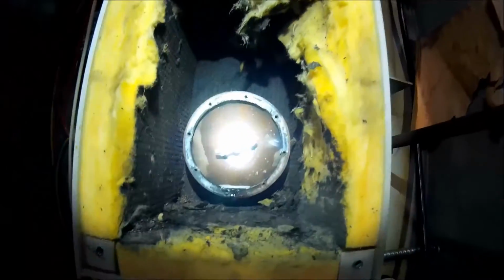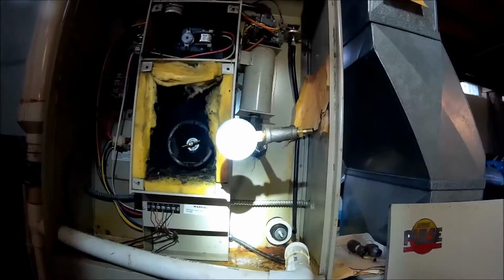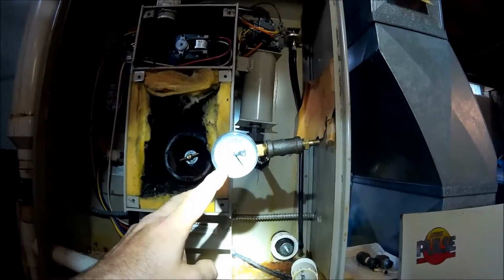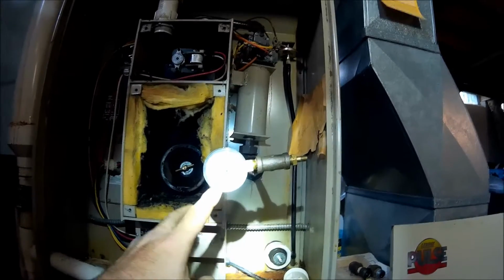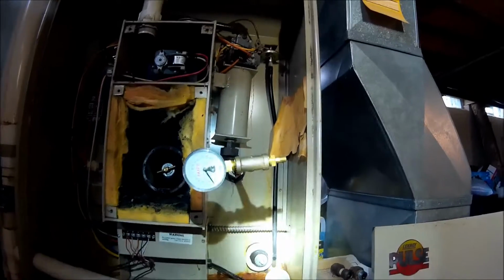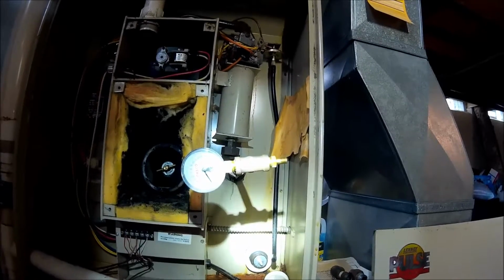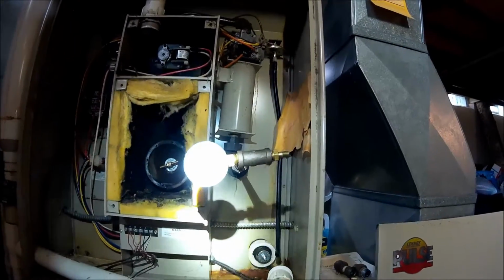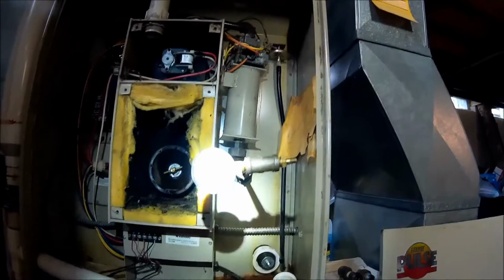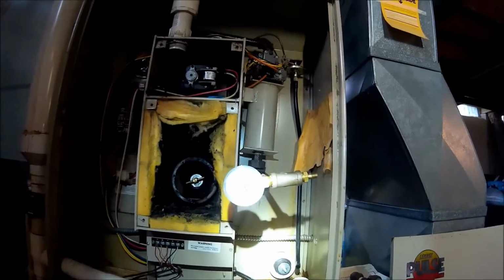And so, how the pressure test is supposed to work is, if you get it up to 5 psi, I think within 5 minutes, any heat exchanger is allowed to leak somewhat, but if it falls outside the parameter of, I think, 4 psi within 10 minutes, it leaks too much and it's a dangerous appliance, could possibly put carbon monoxide in the house.